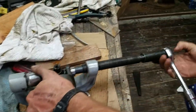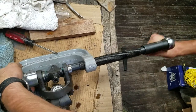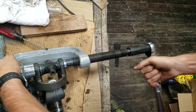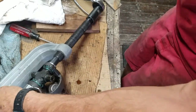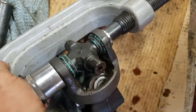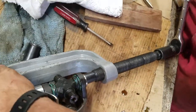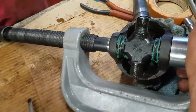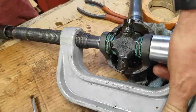A lot of the time I don't even need to leverage it all the way at the back unless I'm pushing two at a time. If you really have to lean into it hard, then something's wrong. You can see I've got my hand at the head of the tool and I'm able to get this one to go in. Now when it starts pushing both of them I'm going to move back on the handle. I'm paying attention to that clip until it's right up against the housing. I can feel it's bottomed out on the bearings — I don't want to put any more on it, so I'm backing this off.